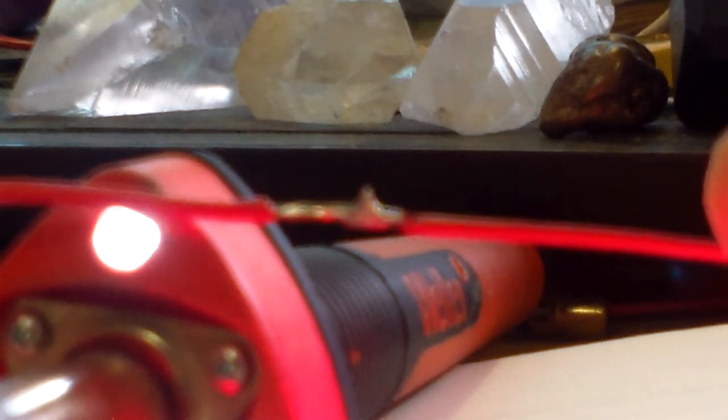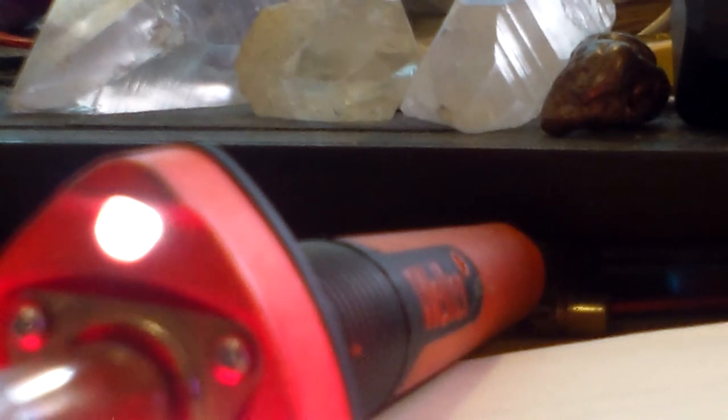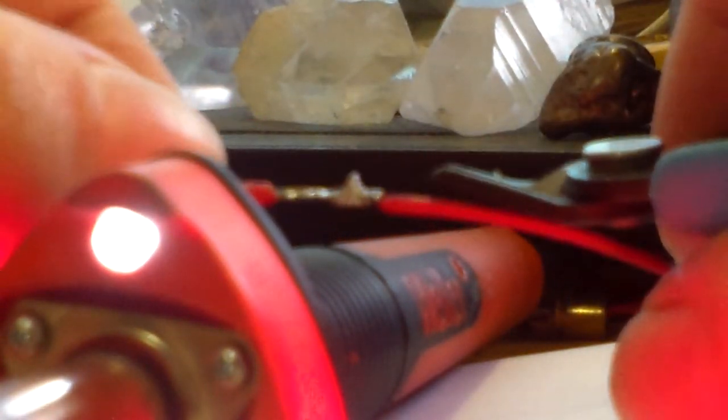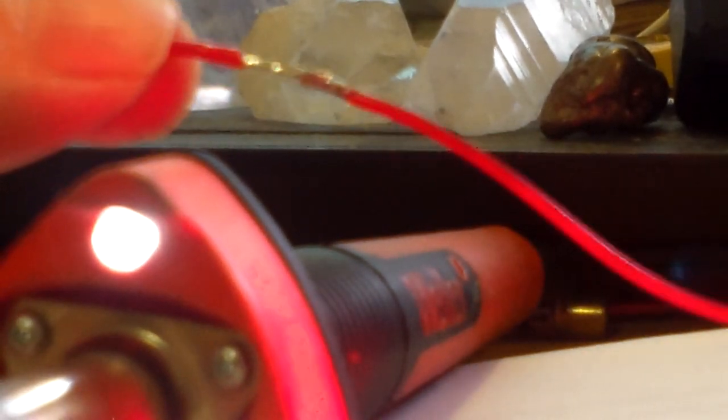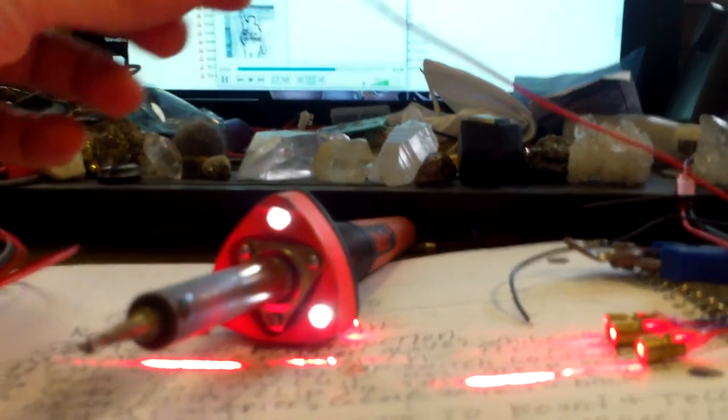You see that little bump on there? This is the perfect time to use your wire clippers — just take that little bump and cut it off, but try not to cut into your wires. There you go, the little bump is gone. Then you'd take your shrink tubing, put it over the joint, and shrink it. That was the little lesson about how to do soldering without using a helping hands.